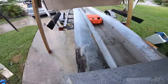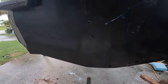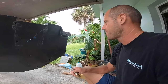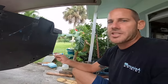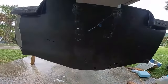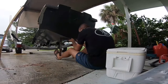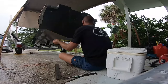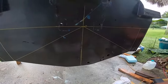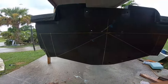Everything so far has just been a rough cut to trim it down to the basic shape, but now we're going to start at the back of the boat and work our way forward. It's going to be important that we get good measurements on the transom — making marks with a gold Sharpie, making some reference points. Number one is going to be the centerline. I'm cross-referencing, doing cross measurements, making sure everything is as accurate as possible since I'm working from the back of the boat forward.